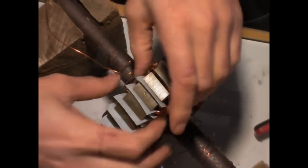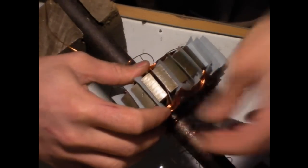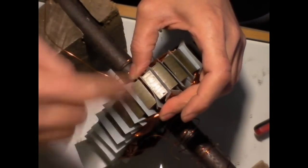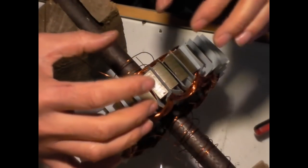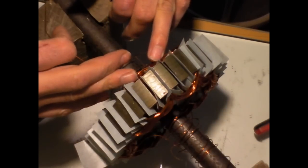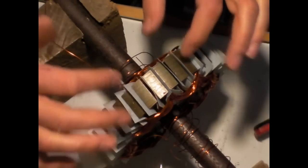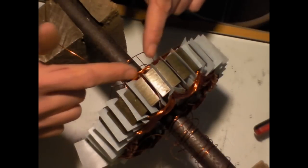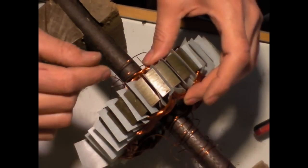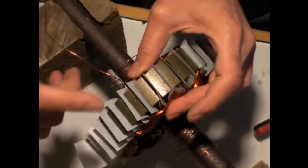After finishing the serpent coil — and the serpent coil was 20 winds — I figured, you know what, since I've gone this far, why don't I just go ahead and put coils, another three-phase coils, at the same time, 20 winds, 20 winds, and so on. So this way I have serpent and coil, conventional coil, set up on the same rotor. While I'm testing it, I will have two outputs — serpent versus coil — at the same time and the same setup. Did I make myself clear?